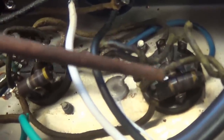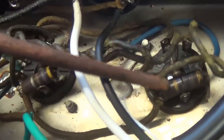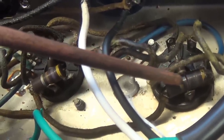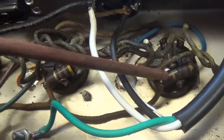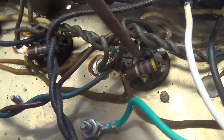Okay, so obviously something went on here. Maybe there was a short in the screen that drew so much current, you'd think it would have blown the fuse. But obviously this screen resistor has been to hell and never came back. Whereas the others look like you could pack them up and sell them for new. Okay, so let's change out these 470 ohm screen resistors and also the 1500 ohm grid blockers that are underneath